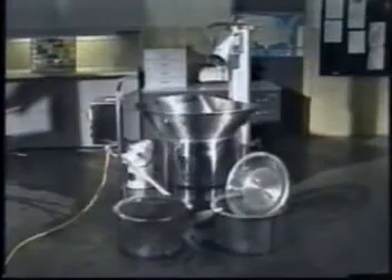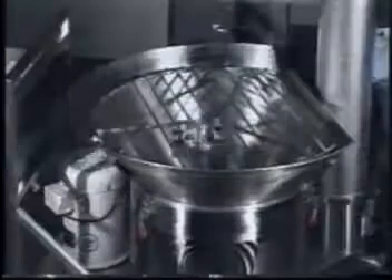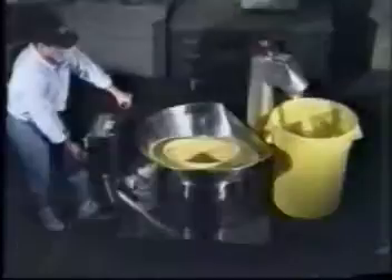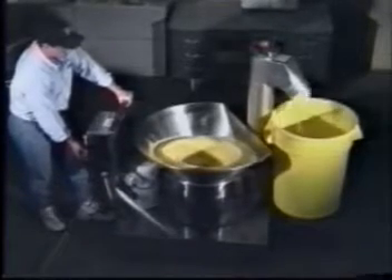The rugged and reliable ES4 is simple in design, operation, and maintenance. Material is dumped into the loading hopper — the hopper safety grate has been removed to improve your view. Feed rate into the sifter tub is self-regulated by a control plate which prevents overloading and allows the machine to start and stop while filled with product. The heart of the system is the vertical sieve unit and rotating impeller which throws material through the mesh with centrifugal action.